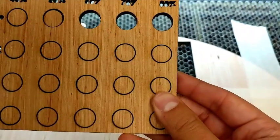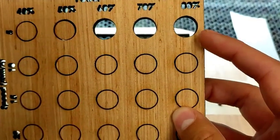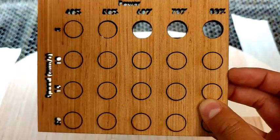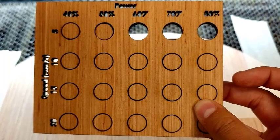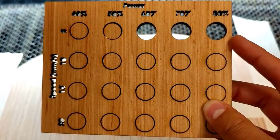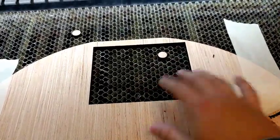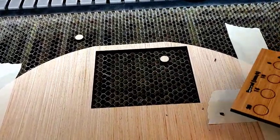This is a good template for this particular piece of wood. I would say to cut at probably 70 or 80% at five millimeters per second, and you might be able to get away with 90% at 10 millimeters per second. The outside square cut for the template I did at about 93% at five millimeters per second — that would be a good level. You could probably get away with 80% at five. I didn't want to go to 95% because that might damage the little metal piece we have underneath, which is there to protect the machine if somebody has the power too high.